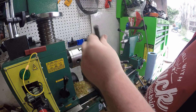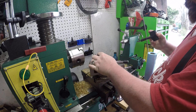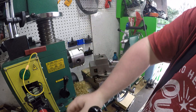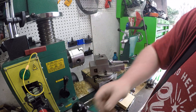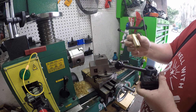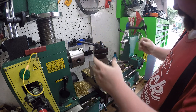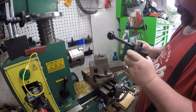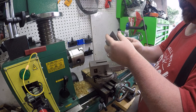The other thing is this base here - the bolt is way too big so I couldn't use that. It's got this insert in here that goes to that bolt. It goes on there and keeps it from wobbling. You can see all the brass shavings - I made a brass insert that drops in there and then set it up here like that.